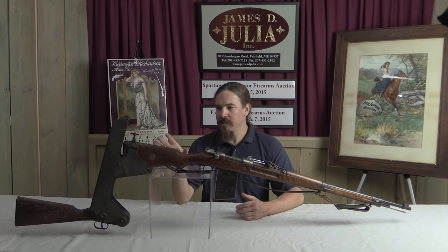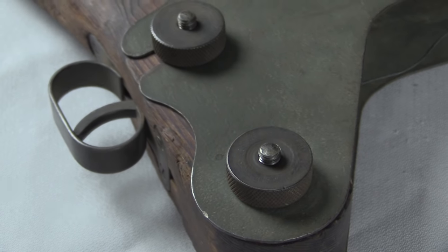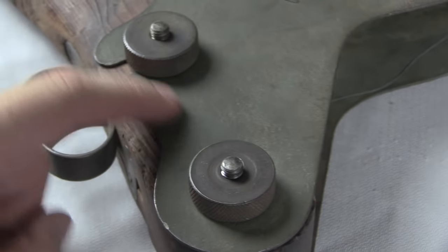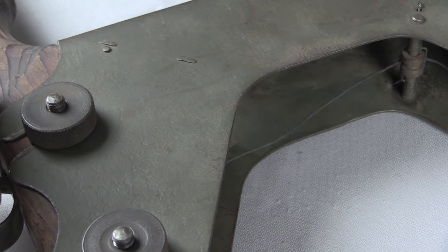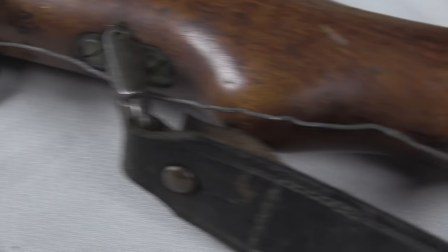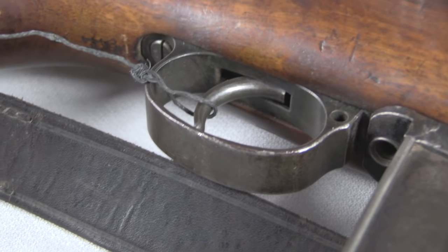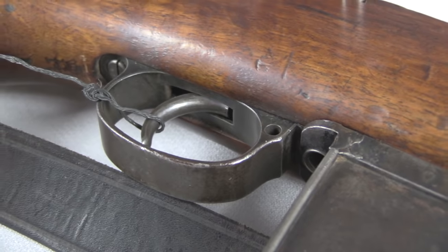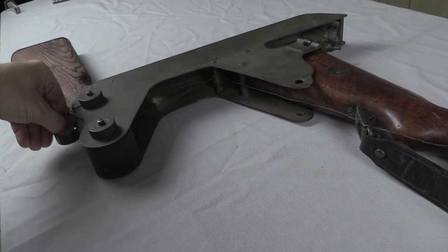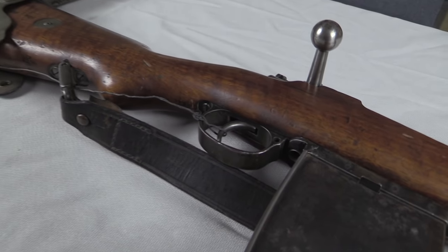Now this is one of the simplest versions. It holds the rifle, and we have this wire — you'll see it up close in a minute. The trigger mechanism on this sort of setup is also pretty simple. There is a lever in here, so when you pull the trigger you are pulling this wire, which runs from inside, comes up through the top of the wood stock, up to a little roller here in the middle of the periscope, and then it comes across through the sling swivel. Originally there would have been a little square metal bracket that would loop around the outside of the trigger guard. That's missing, so someone has simply tied the wire into a loop that hooks around the trigger. When you pull the trigger on the rifle, you can see how that works — it's going to tighten up and fire the actual rifle.